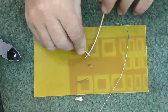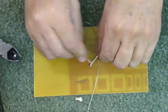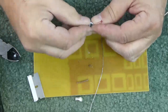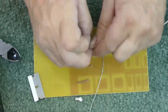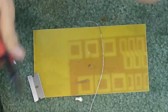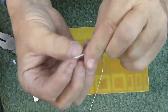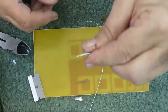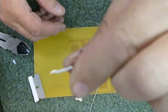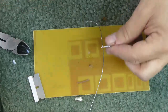Then I do the same thing with the center, very carefully so I don't nick the center conductor. I roll it over and split the insulation, then get a pair of pliers and pull it off. Now I have a really nice end on the cable. That's it — pretty quick to do this.